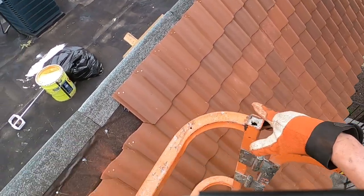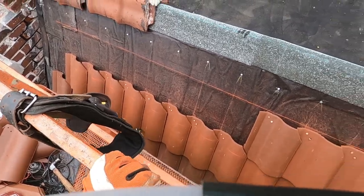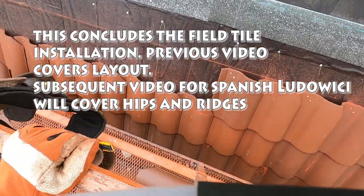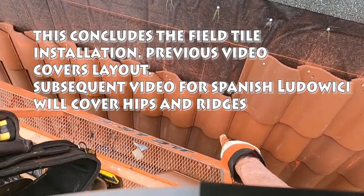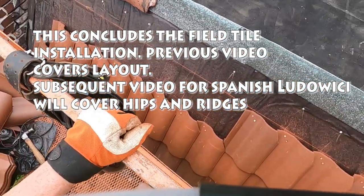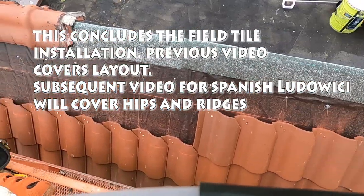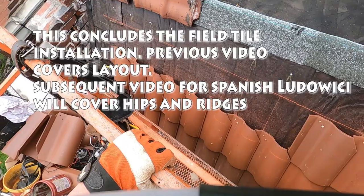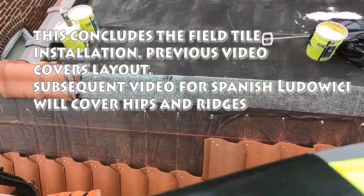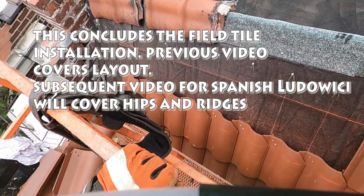Probably would have been smart to do a 24 inch line as well, so you would make the correction in a couple of iterations rather than all at once. But we're not in too bad of trouble. But as I go along, if I pull very far off of that chalk line on this row, then I'm reducing that 3 inches, and the manufacturer, Ludowici, calls for 3 inches. So I don't want to all of a sudden compromise the 3 inches just to make sure that this roof comes in pretty at the top. It's not likely that someone would notice anything unless there's about 2 or 3 inches difference.